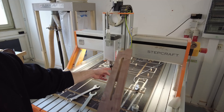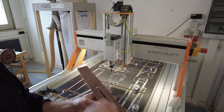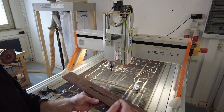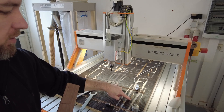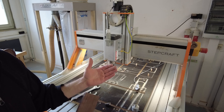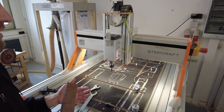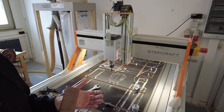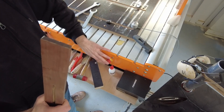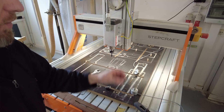One thing that could happen is something like this — this was the exact same router bit and it was loose, so it got deeper and deeper when I wanted to cut out the fretboard pocket. It worked itself down until it went up into the table and the motor stopped. The machine doesn't actually stop on its own — you have to hit the stop button because it simply keeps going no matter what. You really need to keep an eye on it and always have your hand on the stop button in case something goes sideways.